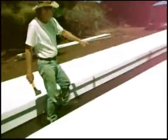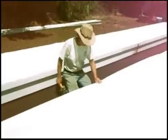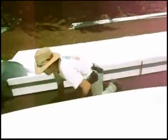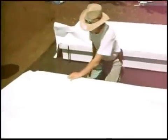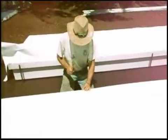I've got it stapled down there and stapled down there. I go right in between the two, take this edge, move it in so it's even with the edge of the two by four — one staple. I go in the middle between that staple and the next one, push it to the edge — one staple. In the middle between this staple and these — one staple. Pretty soon it's straight with the edge and I'll put a staple in about every eight inches or so.